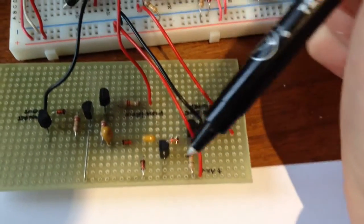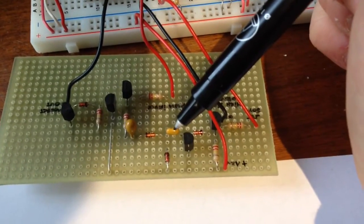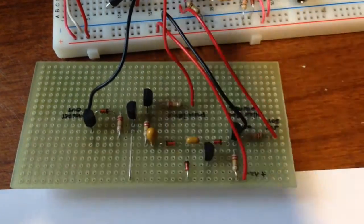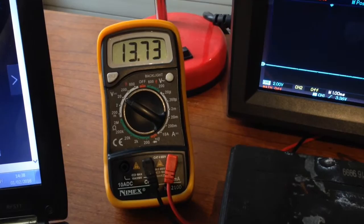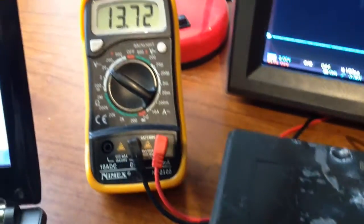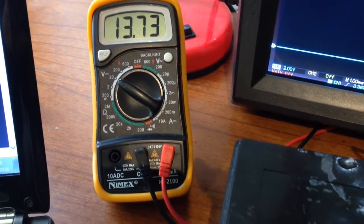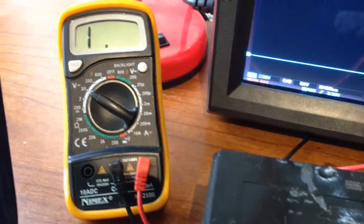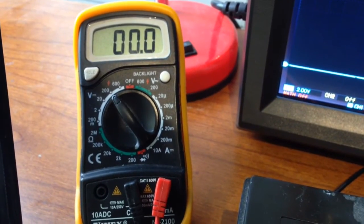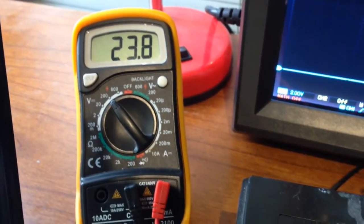That's exactly what I've implemented here. The square wave output goes through a wire to the board, where transistors switch the square wave into a capacitor. Through two diodes, that capacitor charges up to a voltage higher than the battery. We can confirm this with the multimeter: the battery voltage is 13.73 volts, and probing the boosted output — switching to the 200-volt range — reads 23.8 volts. That's very good.